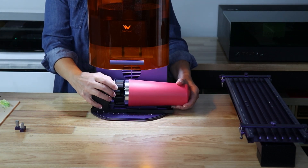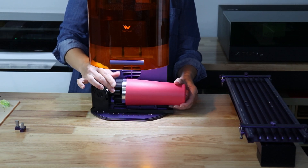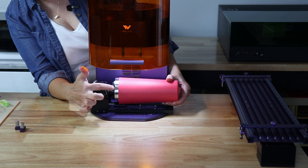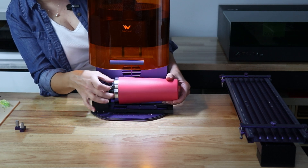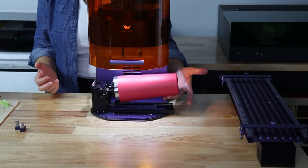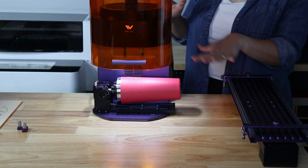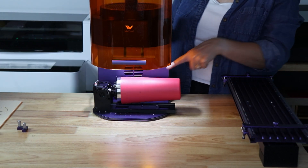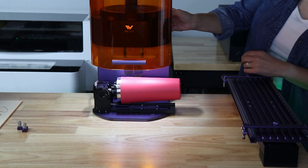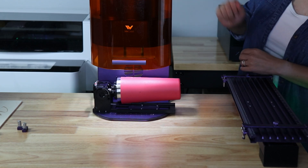I'm going to open this up as high as it can go until it has a really good grip on the inside of this tumbler. I want to make sure the tumbler touches this base plate up here. And because this is tapered, I'm going to use this movement here to make sure that we are level. Everything looks good here. With the Lumos, there are always two dots, and we're going to use this button on the back and just focus it until the two dots overlap. Then we can go to the software and engrave.